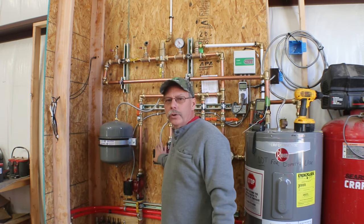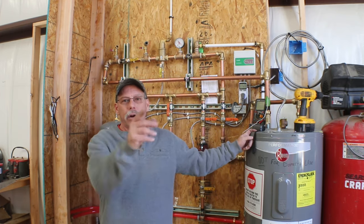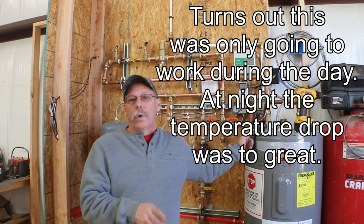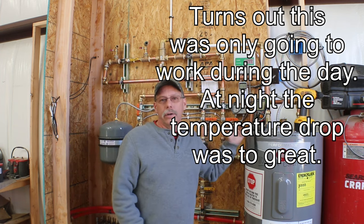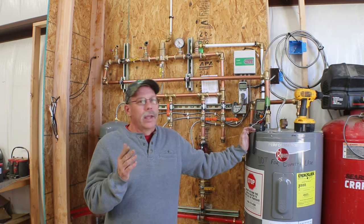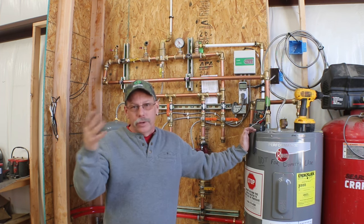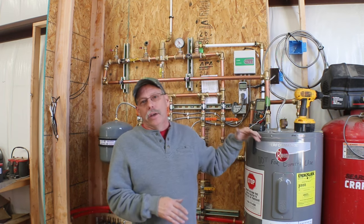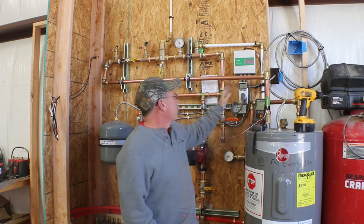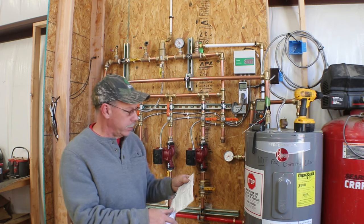First, the pumps could not run for 30 minutes without depleting the hot water heater completely and running cold water anyway. So I'd already started trying to figure out whether I needed 25 minutes or 20 minutes. And it looked like it was gonna need to be about 20 minutes and then let the hot water heater run for about 40 minutes to get back up to temperature. And even then it wouldn't shut itself off that it's reached 135 degrees when I had it set that way. It was just gonna be getting close, and then the pumps were gonna kick back on and essentially suck it out again.